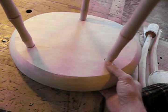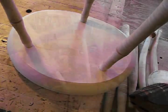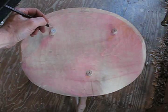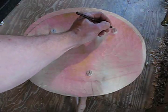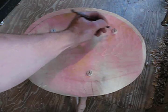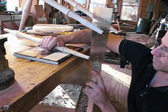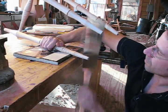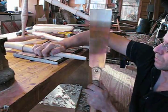Now it's time to see if everything slides in where it should. I flip the piece over and give it a quick wrap to set those joints. I'm going to mark to saw the kerfs for the wedges. I always mark these so that the wedges will be perpendicular to the long fibers of the seat — otherwise you risk splitting your seat. That magazine comes in handy again. I take my Japanese saw and saw right down the line, leaving about a half an inch at the bottom before the score mark. No need to saw all the way to the bottom of the tenon.